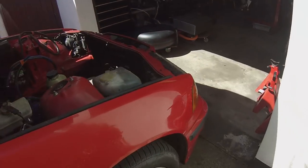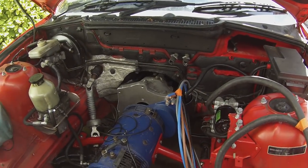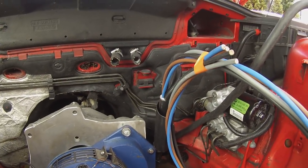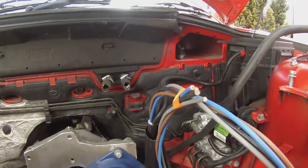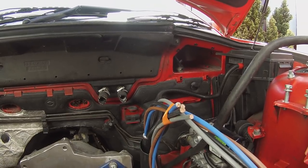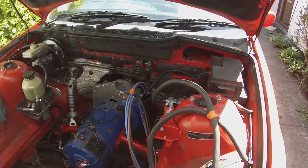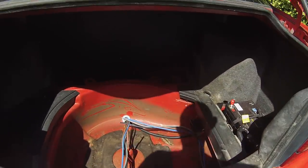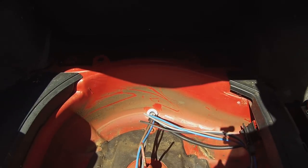The second cable is much more heavy duty. It is a 5x16 square armored cable that's designed for fairly medium duty mains power supply. This is a very common cable in this part of the world, used for supplying 3-phase power to light industrial applications. Now, what I have done here, as we go around the back, is P-clip it all underneath the vehicle, and it comes in here through a gland into the spare wheel well, and I've gotten rid of all the junk from here.